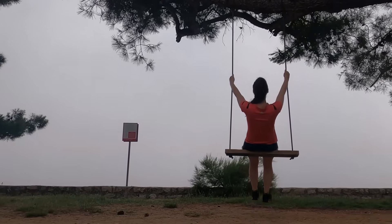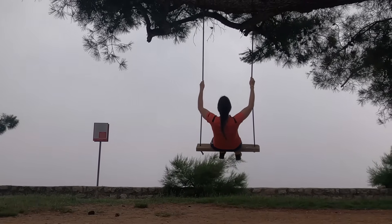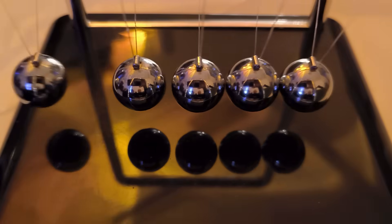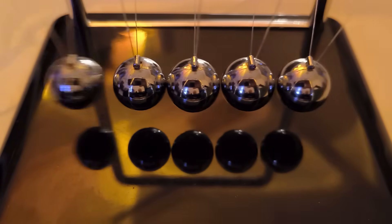This is actually the heart of the clock, and it consists really of two things: a method of storing and releasing energy, and a method of inputting a tiny bit of energy. If you think about a swing — to get your child going you have to start with a lot of energy, but once they're moving, keeping them moving just takes a little tap. A swing is really a pendulum, or a harmonic oscillator. It will maintain that mechanical movement as long as you replace the lost energy.